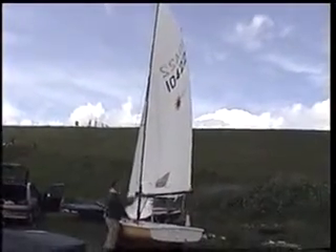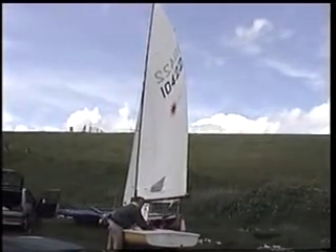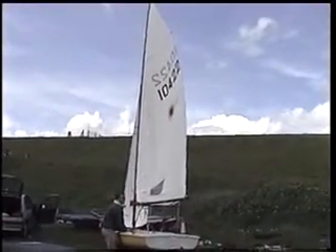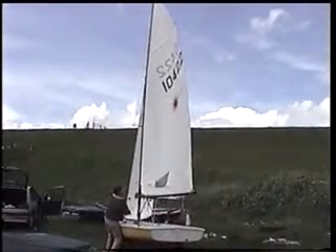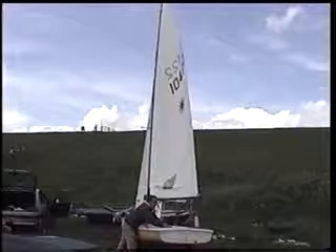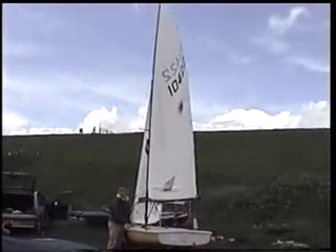You can see the boom's risen up quite a lot — it's probably too high at the moment. But in order to get the boom on the centre line, you let it travel up a bit. Then you can pull the boom block to block like that. Then when the boom comes down, use the traveller to pull it straight so you pull the boom onto the centre line like that. That's how to use the basic controls.